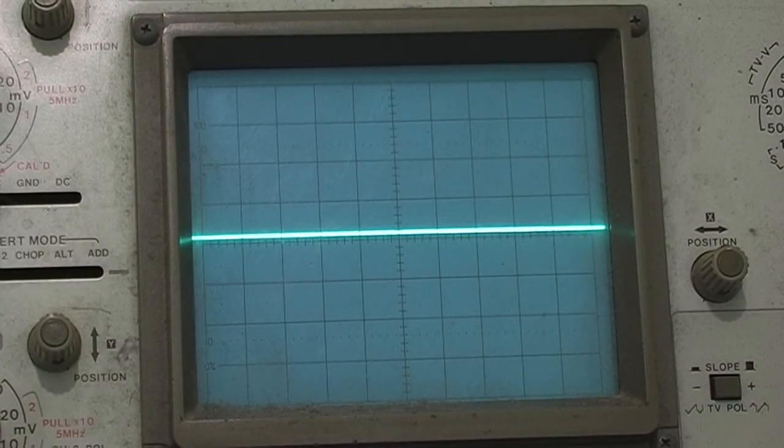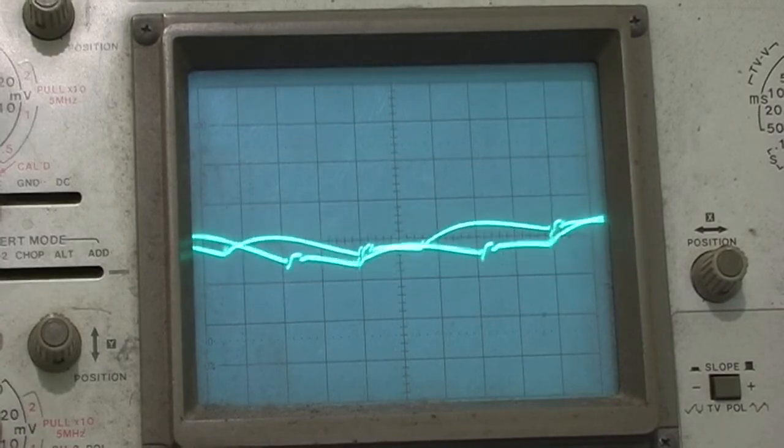There's a couple of different ways you can do this. There's one way where you supply a voltage to the drum and set it for a certain reading. I can't remember off the top of my head exactly how you do it, but you have to stop the drum by hand with the rest of the machine off. But the other way is to connect a 100 ohm resistor between test point 16 and 13. 13's like the ground point. Scope the collector of transistor X9. Put it in play and pause and adjust the thing. So, put it in play and pause.